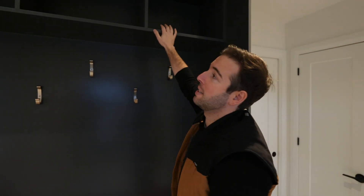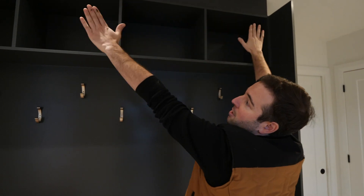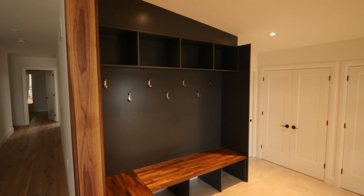Because this exterior product is quite heavy, there's quite a bit of weight up here. To hold these upper cubbies up, I opted to have them sit on top of this panel. They're also fastened in through the end, and we put some framing material up above in the valance, so that top valance triangular shaped piece is actually holding the front of this cabinet up — it's not just a decorative piece to hide a gap, it's actually helping hold this front edge up. The existing ceiling is quite wavy, so it was an extra challenge to get this triangular shaped piece fitted tight to the ceiling. We cut it oversized, put it in place, scribed it to the ceiling, then cut out that scribe line. Now that it's installed and painted, you can hardly tell — it definitely disguises the fact that the ceiling is all over the place.